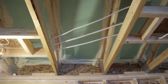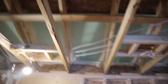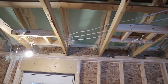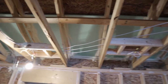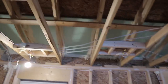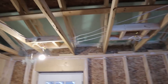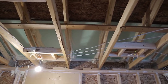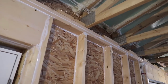Oh, did I explain what these baffles are for? I think I did. So you can see a gap up there. You can see a little styrofoam block. And this does two things. First, it blocks any airflow from getting into the insulation low down near the edge. And it allows cold air to flow up along the ceiling, along the roof sheathing. So it's a cold roof system. And then the insulation is just going to rest against that on the underside. And the baffle keeps the insulation from clogging that up. So I should never have any sort of ice dam issues ever. Unlike our current house where you have to put up heat tape and run it, like it's on right now, just wasting energy trying to melt the ice that's forming on the edge of the roof. Because that diagonal member would go straight down to the outside and there'd be no room for insulation.